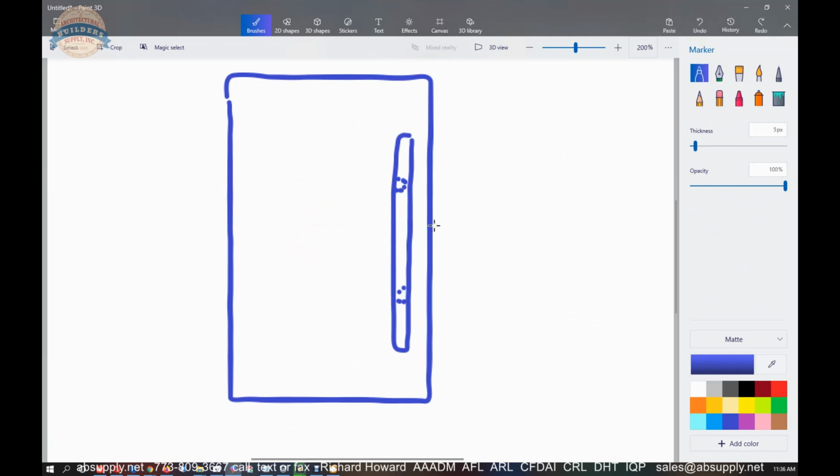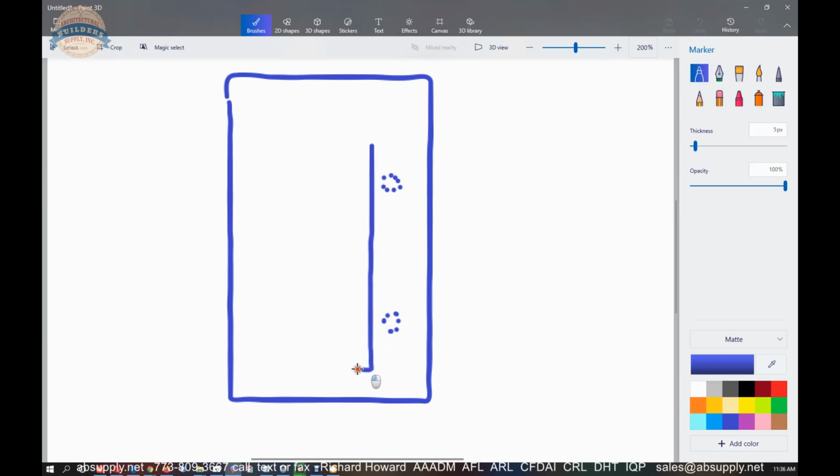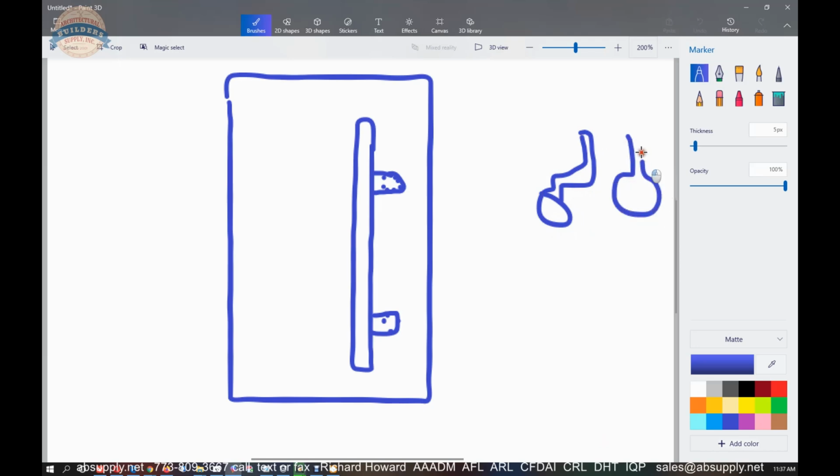Now what some other people will do, which is a really great idea and is the proper idea for a door pull application, here are my 2 mounting posts. They'll have the door pull offset. The mount is going to look like this versus like this, so that the center line is moved over. So, an offset pull. You want to be able to get access to the cylinder where you need it. So be mindful to think that through.